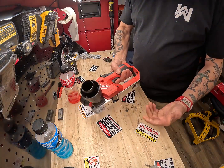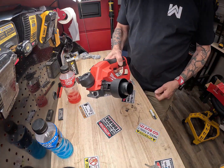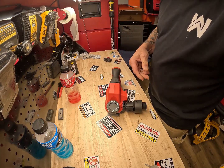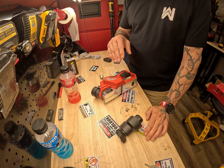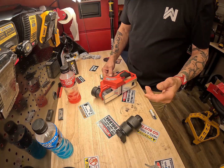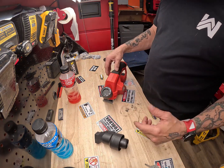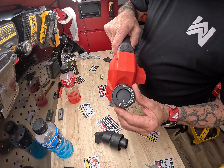But anyways, it's a little 12 volt planer. You know, it's not very loud. You can shave a door down, or whatever you want to shave down. Like I said, the reason why I got it was because I'm always coming across a door that I just need to knock the edge of it off. I can take my sander to it, but you know, they got dust all over the place, and you have to grind it down so much to get the door to not catch. Because if you just barely miss the door frame, the door might swell, and then you got the same problem. So if I can just take off just a hair, because it'll go down. I mean, that's pretty freaking fine cut. You know what I'm saying?